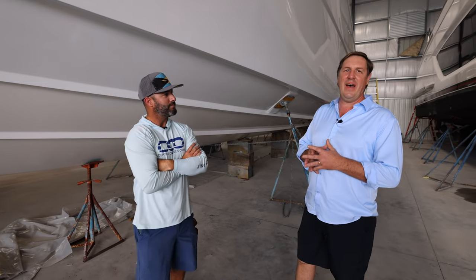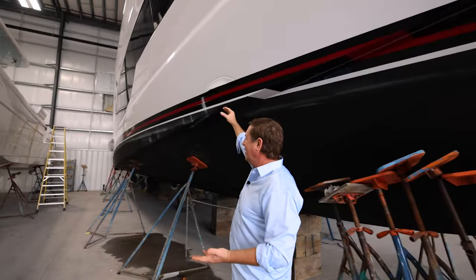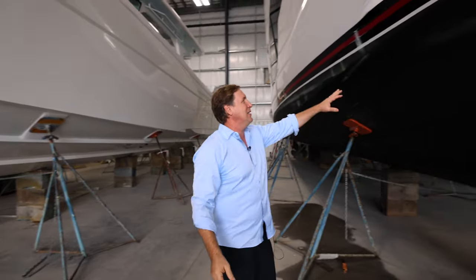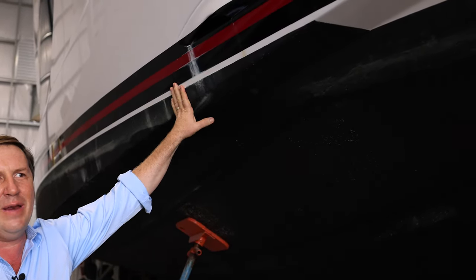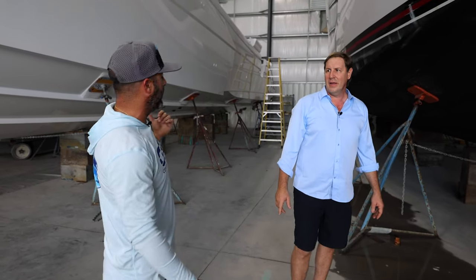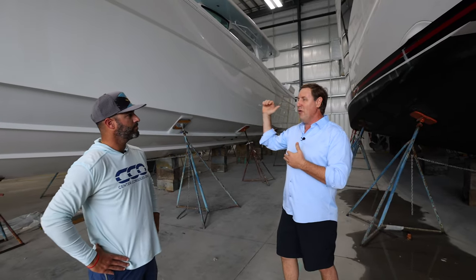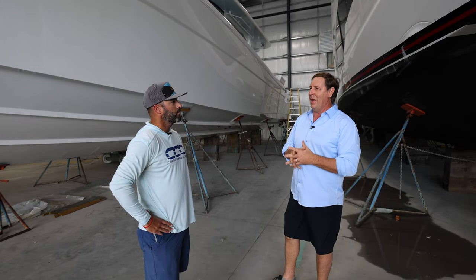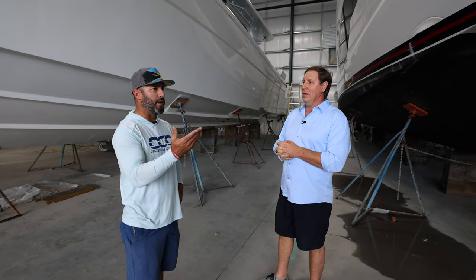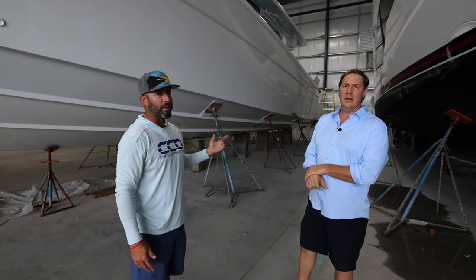Since we're at Hinkley today, we recently did this 55 Hinkley and we're going to show you that in a little bit. Look at this boat right next to it - look at how ugly this is compared to that. This is a traditional anti-fouling bottom paint, and you still have to maintain it. You're still going to get buildup, and you have to reapply it every year or every 18 months. The performance difference is where you'll really notice it, because traditional bottom paint is so abrasive it destroys your fuel economy and top speed - that's one of the huge benefits. And we haven't even touched on resale value. A boat is a lot more valuable without bottom paint than with it - we've heard through brokerage it could be 10 to 20%. A center console with bottom paint is a lot more difficult to move on the pre-owned market compared to something like this that doesn't have it.